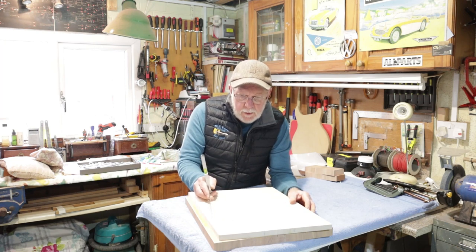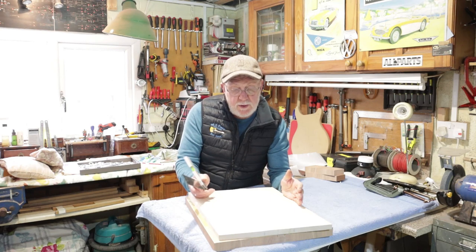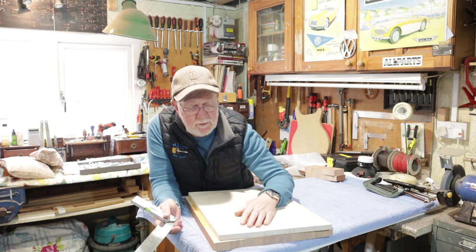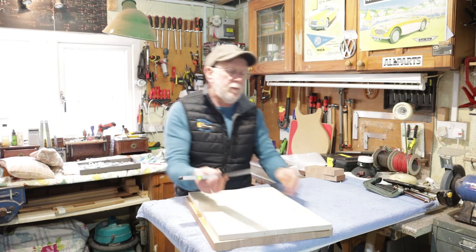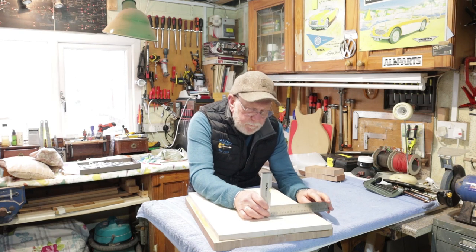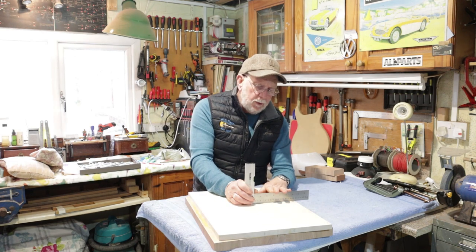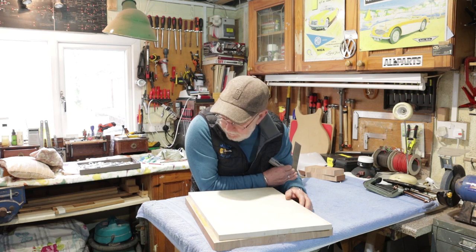When they machine it, their blades feather away off to one side. And two pieces I've had off them have been exactly the same, and I've questioned it. So if you have a 20mm top, by the time you sand it up and joint it up, you're going to lose a few mil. But with this, I could be losing as much as 4mm. This was going to be the other side. But if you look here, there's a gap right on the end. I didn't notice that little gap until I was due to glue the top on. So I had to stop what I was doing and clean all the glue off. Absolute nightmare. Terrible, terrible. I thought I was going to scrap it, to be honest.